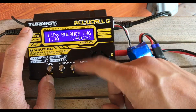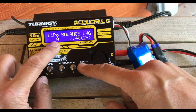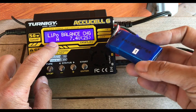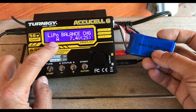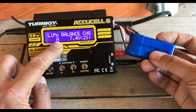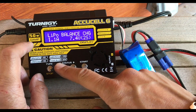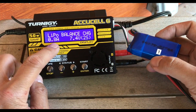You're going to see the amperage blink, and this asks you how fast you want to charge the battery — how many amps to run through it. For safety reasons, we're going to do what's called 1C, meaning we charge at 1 amp per 1000 milliamps of capacity. In this case we have 850 milliamps, which is less than 1000, so we're going to set it to 0.8 amps. If the charger had 0.85, we'd use that, but we round to 0.8.